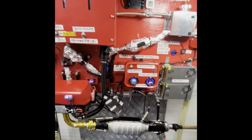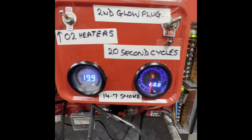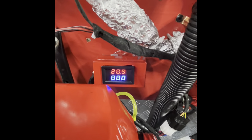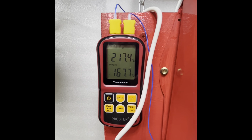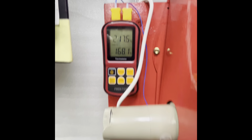Okay, back again, still on number one. I've brought up the supercharger quite a bit - my emissions have gone back to zero. Got a nice in-chamber temperature of 882°C. I've got a heat exchanger temperature of 217 and steady - still leaving and climbing. What I want to do is go in and make a cup of tea but I think I can risk it. As long as that's holding, that's the main thing.